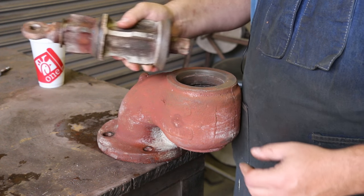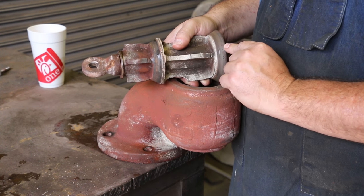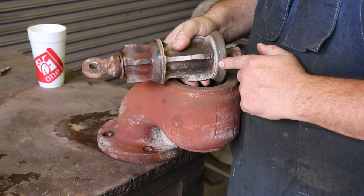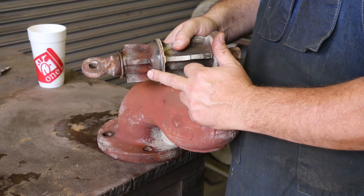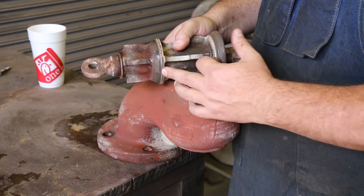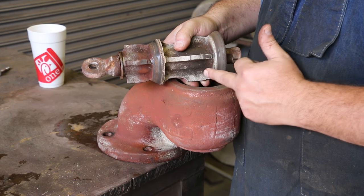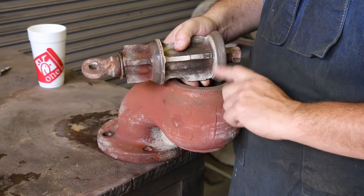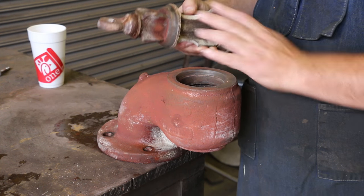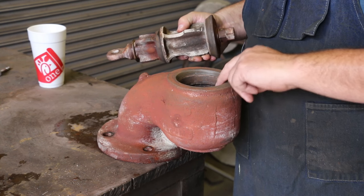To do that, we're going to take the actual valve part here and mount it up in the lathe to run true. We're going to very lightly take a cut off of both of these. It's tricky because we've got to take the same amount off of both of them, because these have to be aligned with one another. If you take more off of one than the other, one valve is going to seat and the other one is not. We've got to get this trued up. And then once that's done, we'll come back over to the actual valve body here and lap the valve to the valve seat — lap the valve seats and get them all trued up and running perfectly true.